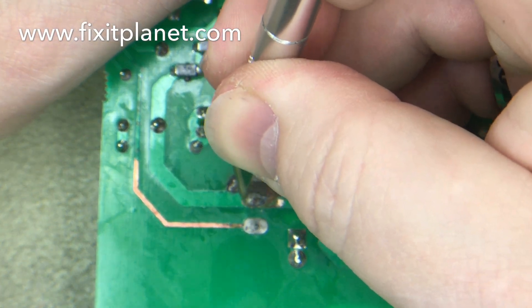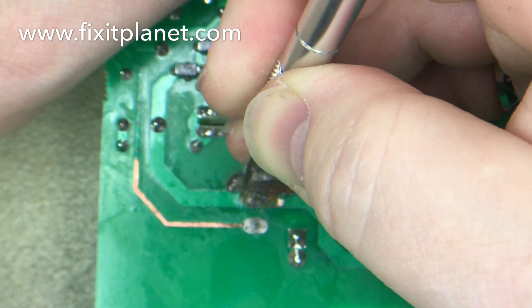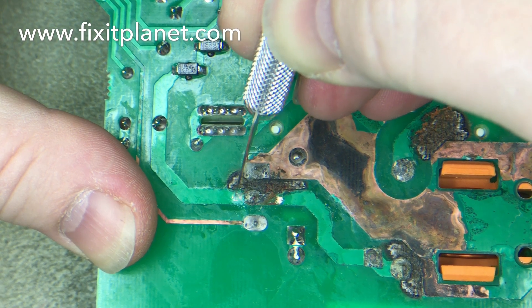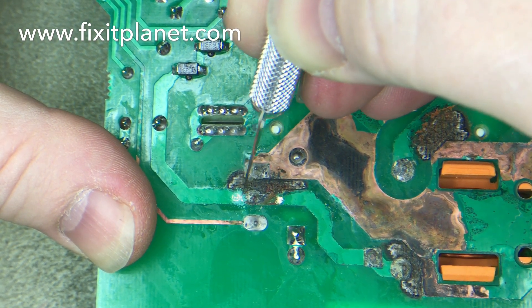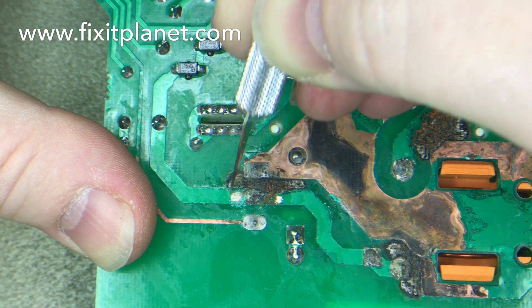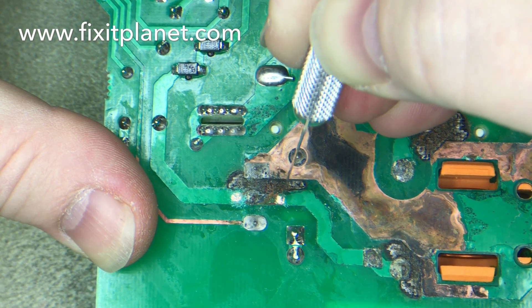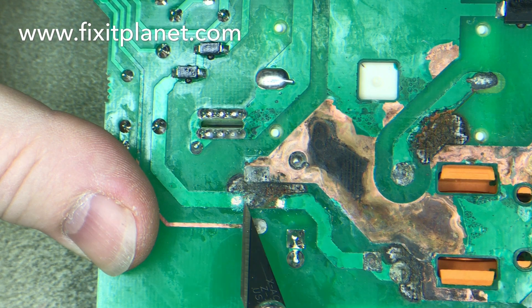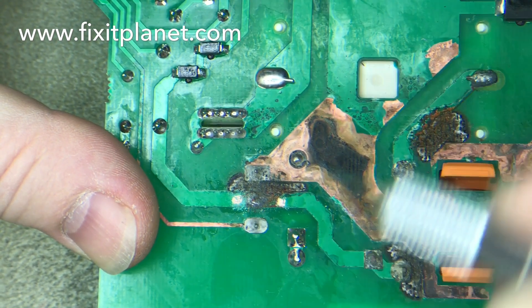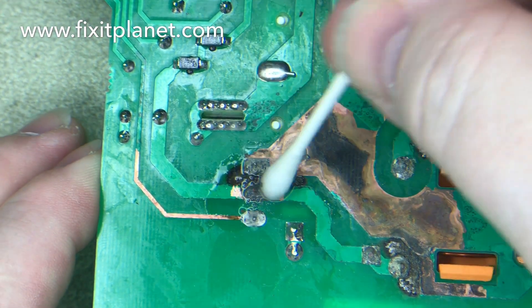This one location has a three-leg transistor on there and the center leg is not making any contact, so we need to correct that. We're just going to run a simple jumper across that broken trace and get that line reconnected, then touch up some other areas as well. In this process you'll see me put some probes on — although you won't hear any beeping — I'm just checking continuity. At the end of the repair I checked to see if the unit was drawing current, and that was about all I could do from my bench to test it.